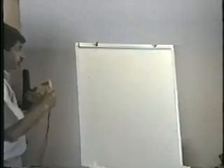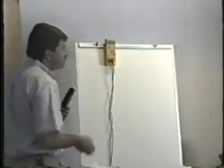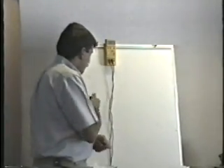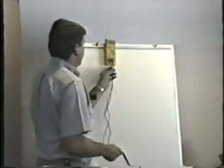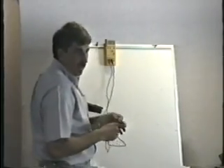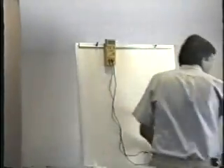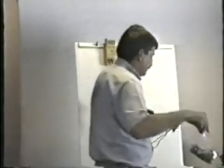If you look at the chart on the top of page 10, this tells you how the transistor test works. You're using the diode test setting of your meter. Don't do it now, just watch me. You're going to have a chance to do 40 transistors in just a few minutes, because I've got this big bag of transistors here. You're going to check every one of these — half of them are good, half of them are bad.